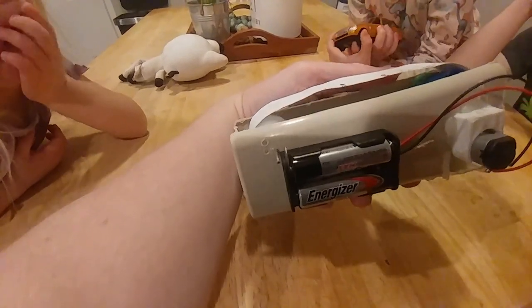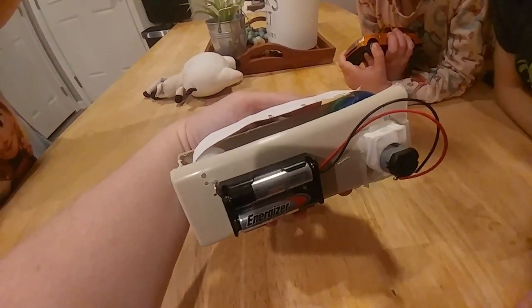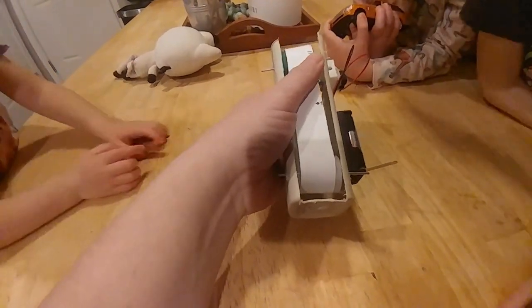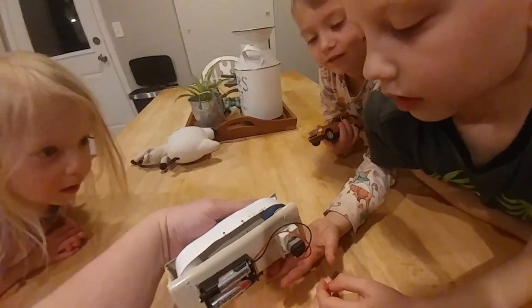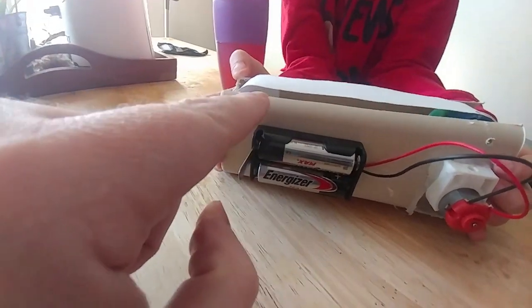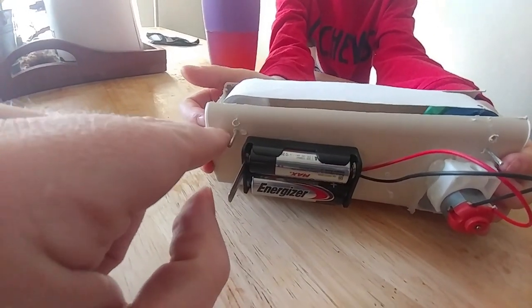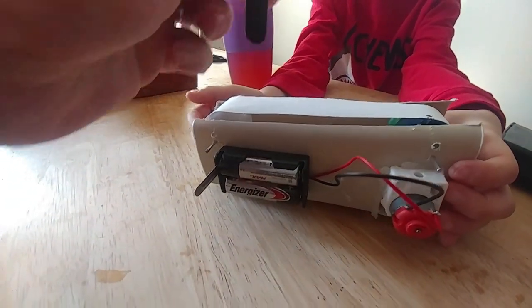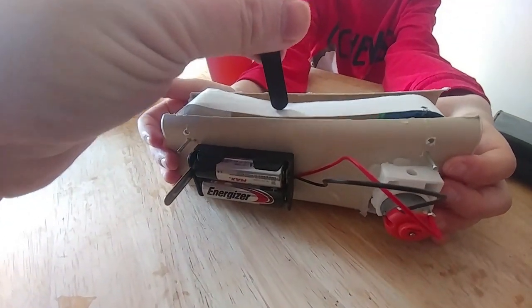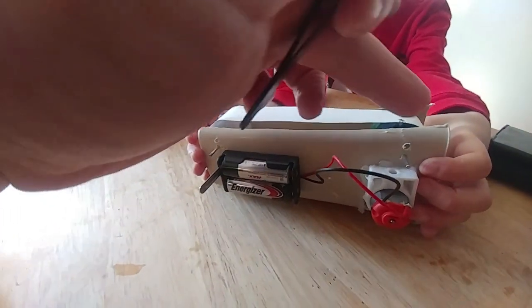Now, why don't we try moving this back pulley a little bit further back. You see I've got some more holes back there, to see if we can space it just enough to create tension on this belt, but still allow operation. Let's try that next. All right, okay, so we took our back pulley and we pulled it further back and put it into these back holes instead of front holes. And we can see that we have quite a bit less deflection in our belt now. So there's greater tension between here and there.